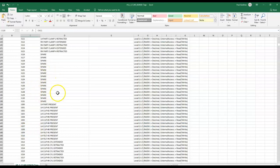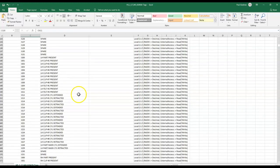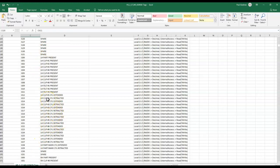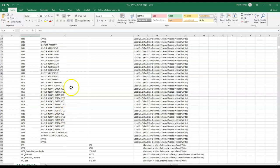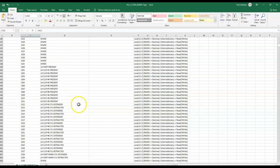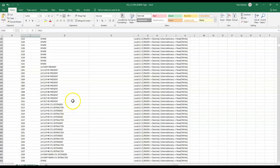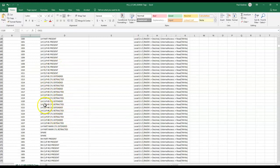Notice I have several spare and that's okay. The reason is I don't have anything else to put in there at the moment, but when I begin to list and count out, I have 30 inputs on my left nest — a 32-bit card would cover that. So if I split this and put a bunch up here and a bunch down here, it'd be very awkward when I'm defining my tags. I can do the exact same thing with the right-hand side. Having a few extras is not a bad thing because you may end up sometime later needing to add something into your machine that's not necessarily in the nest.